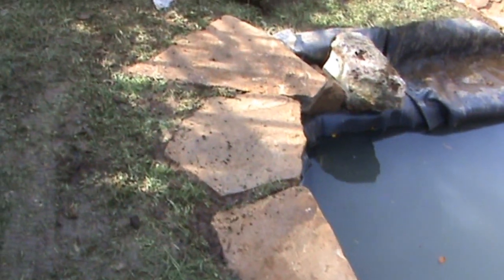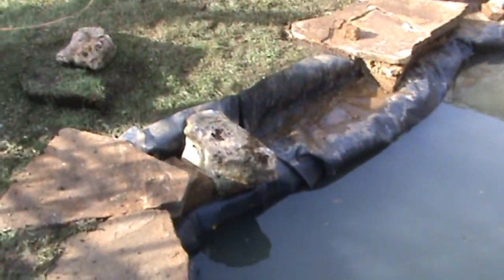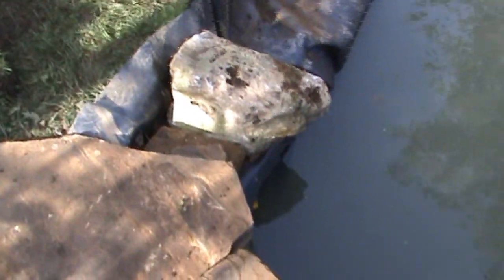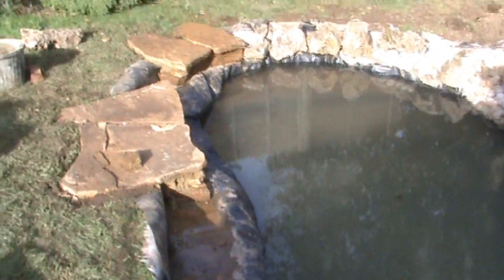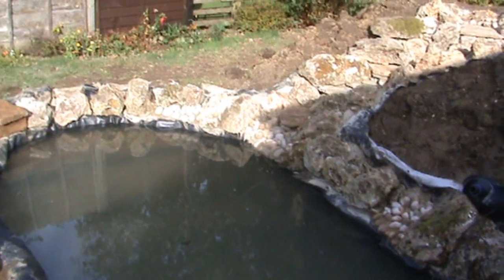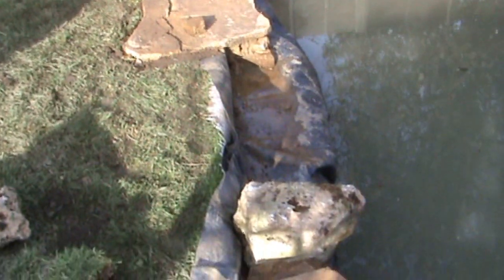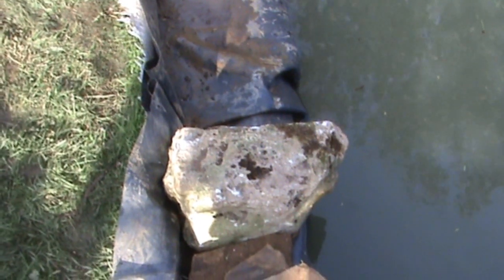After getting halfway around with the large edging stones all cemented on, we decided it would look a little bit too much if there were big edging stones all the way around. So we actually demolished a bit of the dry stone wall and instead of the big edging stones we're going to put these rockery stones in, just to break it up a little bit. It would look too uniform if it was all just flat stones. By putting the big rockery stones it'll tie into what's happening on the far side with all the rockery stone there. With these we're trying them in position first, whipping them out, putting a bed of cement down and laying them on the cement - exactly the same as we did for the big flat stones.